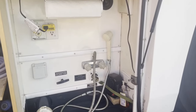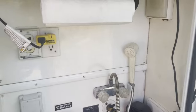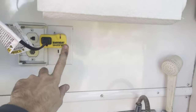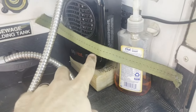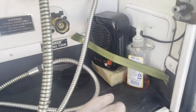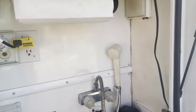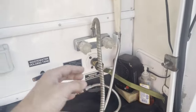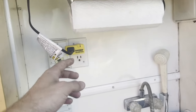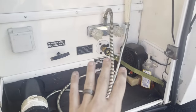I'll go out and show you where I've got those. One of my wet bays in the winter time is set up like this. I actually leave it plugged in year-round, not just in the winter. I've got the Easy Heat plugged into the outlet there and I followed the cord up and over down to the little heater. If you were concerned, you can always flip off the switch, unplug it, or remove it in the summertime, but it's not in the way for me. This just puts out a nice gentle heat with the fan and blows until the plug reaches 50 degrees, then shuts down until it drops below 38 and kicks back on again, keeping this area nice and toasty.